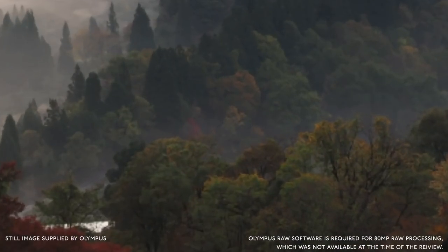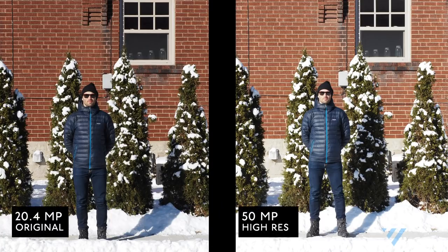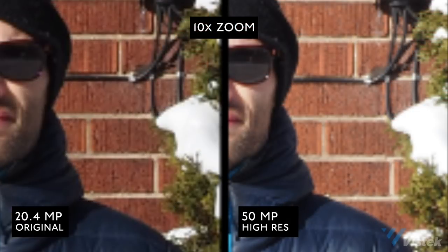Next up is the high resolution oversample. If 20 megapixels is a bit small and you've got your sights on big prints, this feature attempts to address that. By taking the IBIS sensor and shifting it during the photograph, it takes multiple exposures to increase pixel density. Olympus says you can get an 80-megapixel raw equivalent image. The photos they sent were quite impressive, but I wasn't able to get the exact same results — processing the raw image inside the camera only gave me a 50-megapixel JPEG. Putting the two photos side by side, the high-resolution photo does have increased clarity and detail, but zooming in I don't really see two-and-a-half times the resolution. This is really about photos with increased detail and better printing, less about recropping. It's a cool feature, but I don't think it replaces the need for a high-megapixel camera.